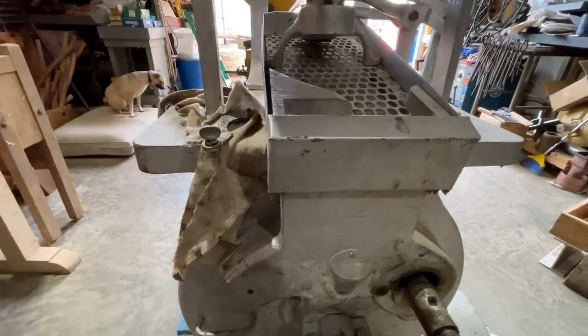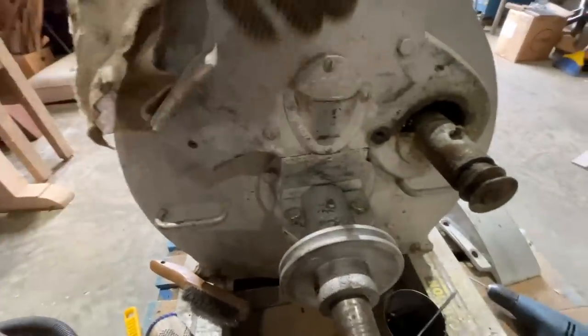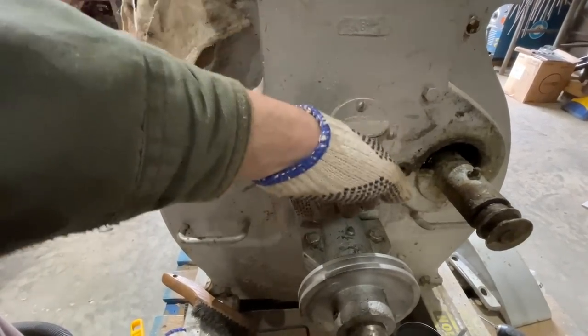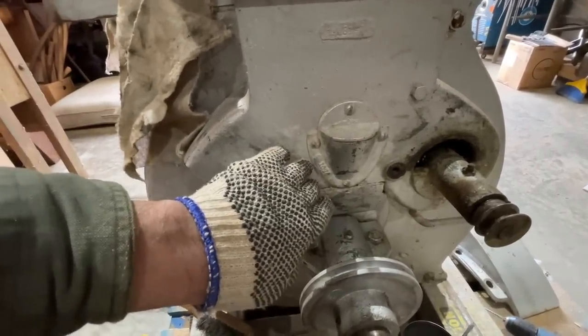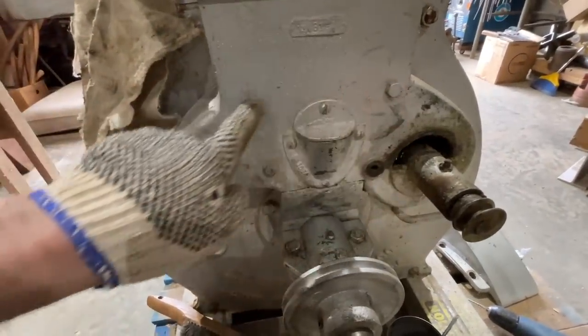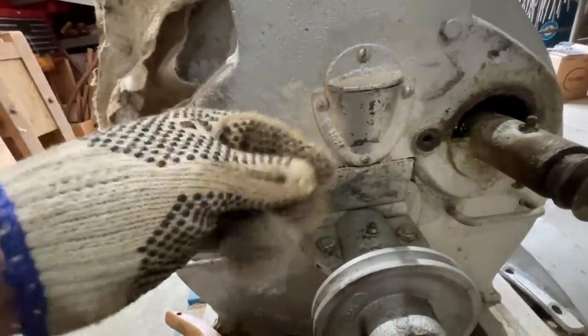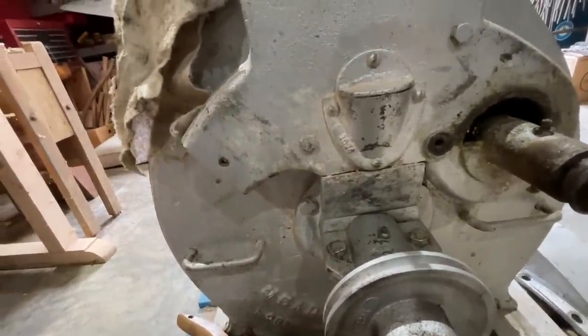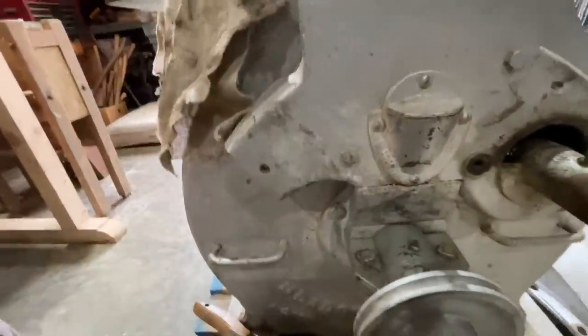The grain comes out of the hopper, down through the feed cup, down through the shoe, and it goes down into the mill here. As the grain falls down to the shaft and the auger to be pulled back into the millstones, it blows a current of air across that grain and it comes out over here, in this opening. So any fine particles, pericarp, any of those fine little dust or anything else that might be in there that's light enough that don't get separated out with the shoe up here, it will just be blown out over here before it goes into the mill to be ground.